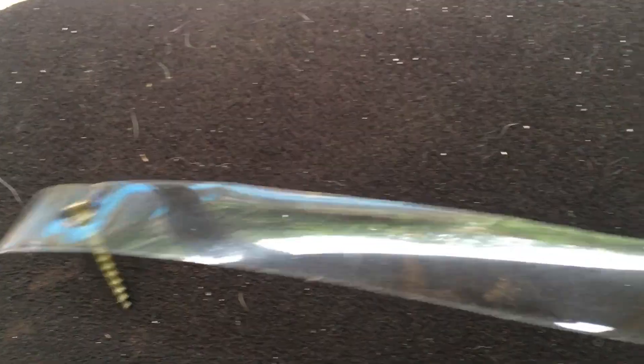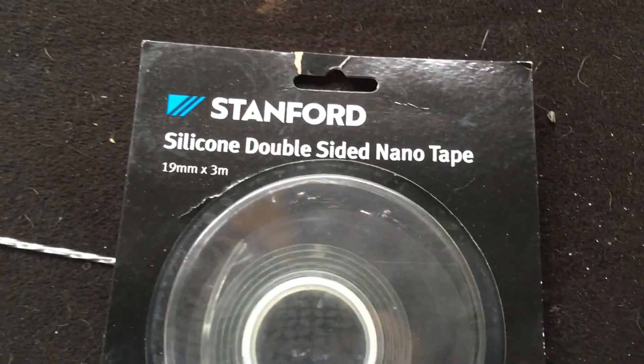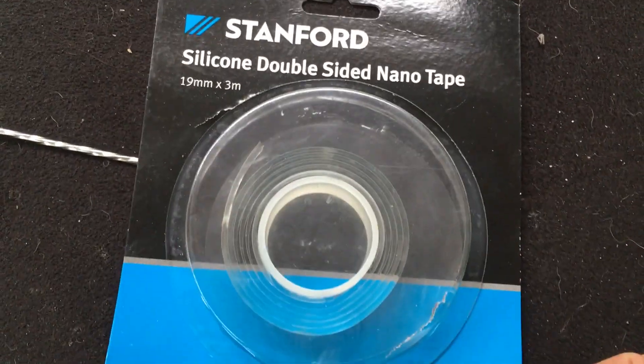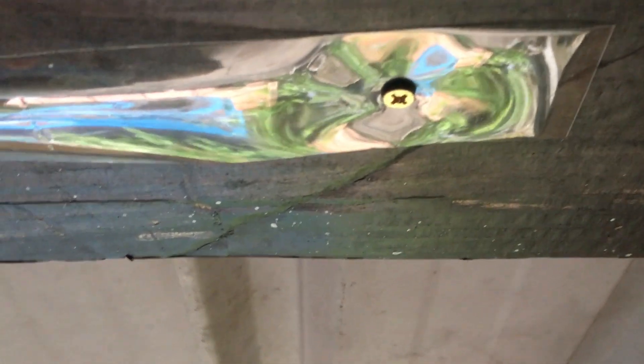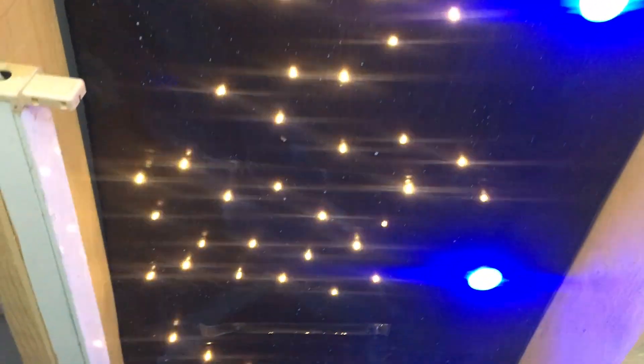I've got all my lights in place now and I'm going to cut the cardboard to size and attach my panels to the beams. I've taken a two-litre soft drink bottle, cut it into strips, and inserted the screws so they're easy to drill into the beams. To help me attach the big piece while I'm trying to pin it up, I'm going to be using this silicone double-sided nano tape — this makes it easier to have it slightly secured so you can screw the screws in. The plastic holds the roofing up so the screws don't just break through the cardboard. I've got the roofing up — here it is without the lights on, and now with my lights on. Extremely happy with how that's turned out.